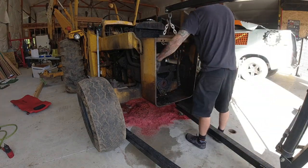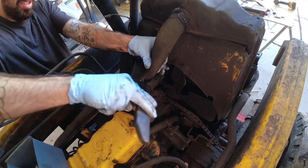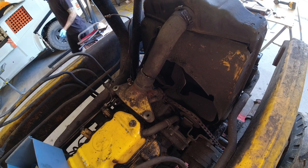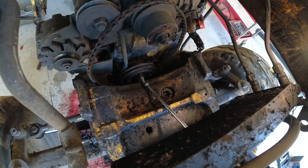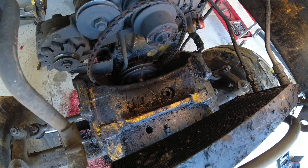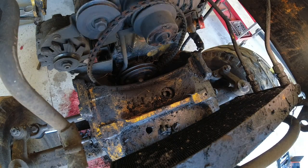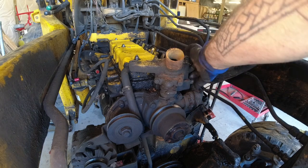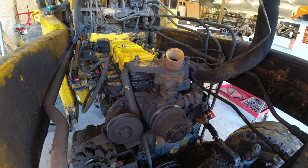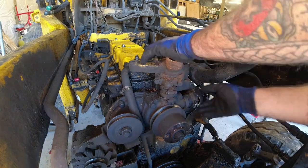Another super heavy piece of steel. This front plate on the crankshaft has a left-handed thread shaft that slides all the way through the front axle housing, and then goes to the hydraulic pump on the front. Here we've got our water pump, our water outlet, and our thermostat.